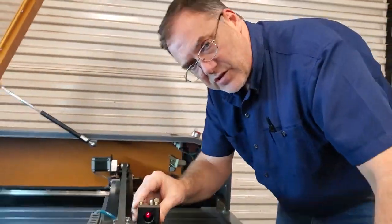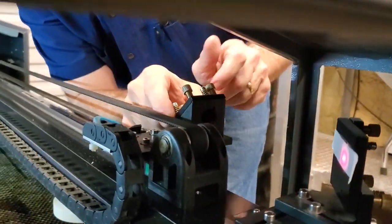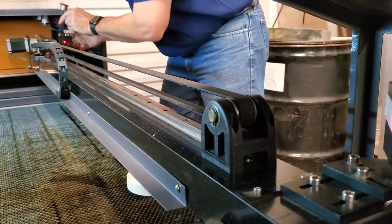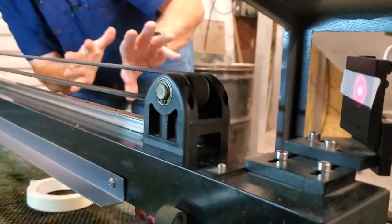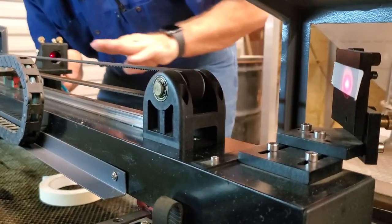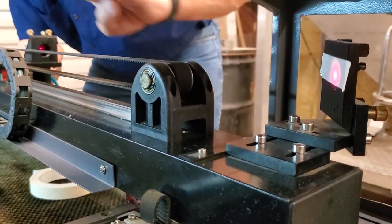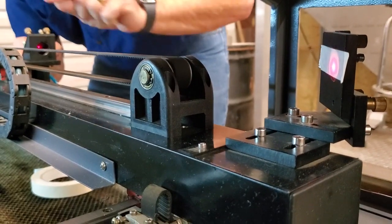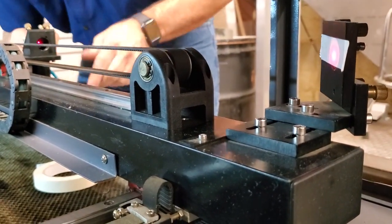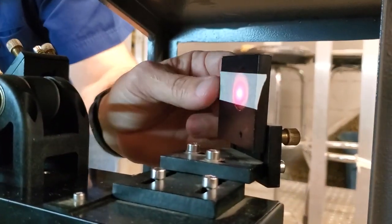After I lowered my mirror, I line up near mirror three and bring it up close to mirror two. I do an alignment here and adjust — the laser is always on so it's not burning anything, it's real quick. I go back and forth so it doesn't move, and now I know I'm aligned at mirror three. This line is the level where the laser needs to be at this height to get 90 degrees and hit dead center.